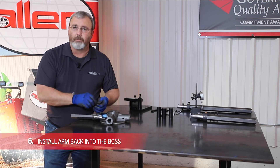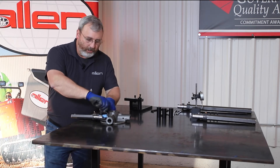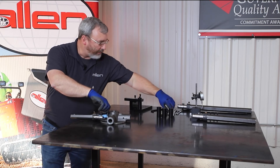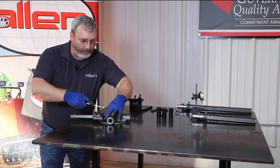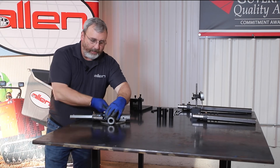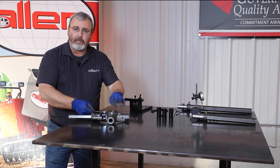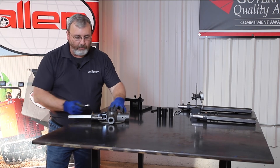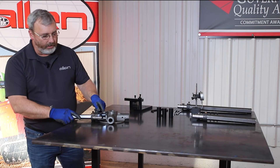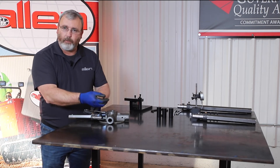It's best to go ahead and put some grease in there. Make sure you grease your Spyders daily when using the machine. It takes a 9/16 wrench — put the dog leg screw back in and tighten it back up. You can take this off while it is still on the machine without having to pull the whole Spyder off the gearbox. You can stick your 9/16 wrench in here, pull this, and it raises up underneath the pressure plate.